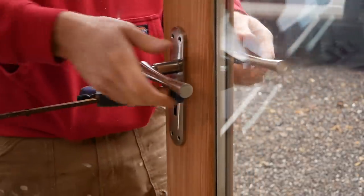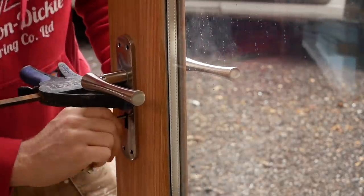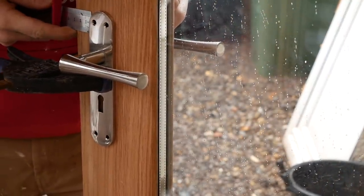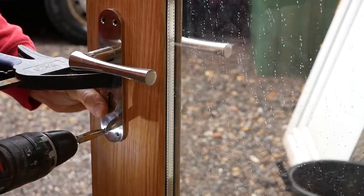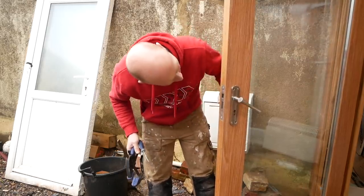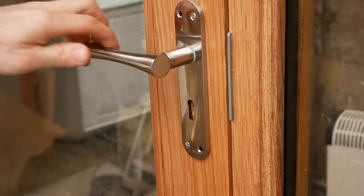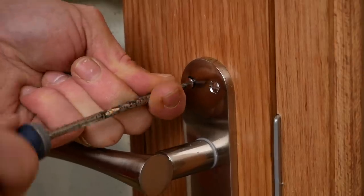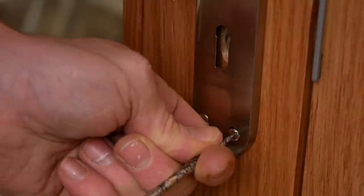This part was really quite straightforward. I sat the handles on both sides, made sure they were lined up, and also checked the key was able to move in freely. I then took a ruler to make sure we were equal on both sides. After a good play around testing that everything was freely moving, I put in the remaining screws and that was it. And remember folks — line those screws up, whether you're a horizontal or vertical slotted person, get them all matching.